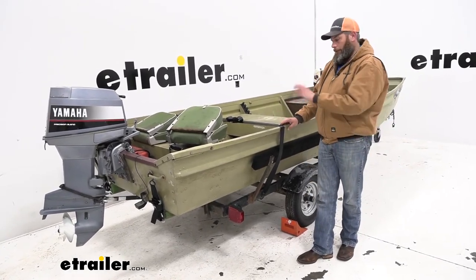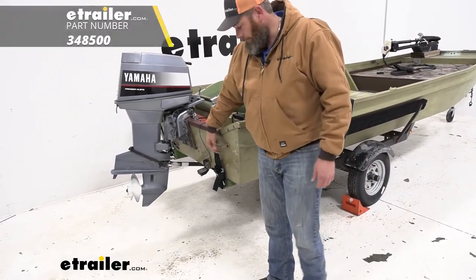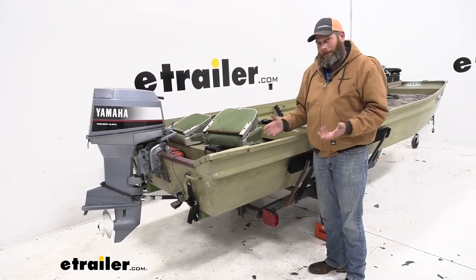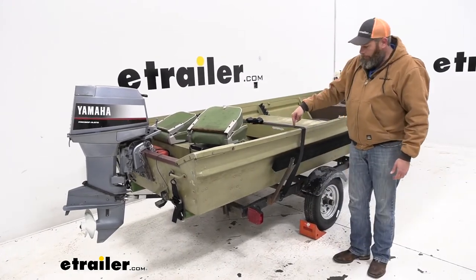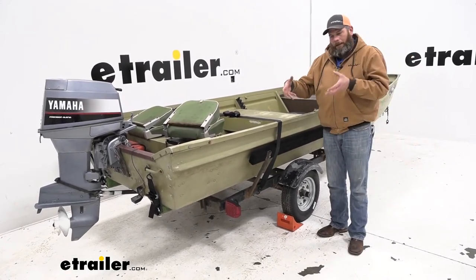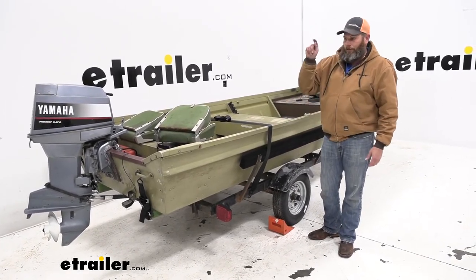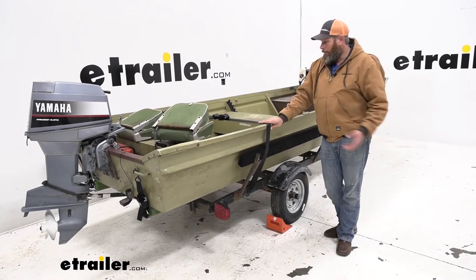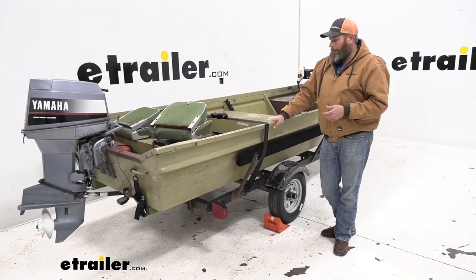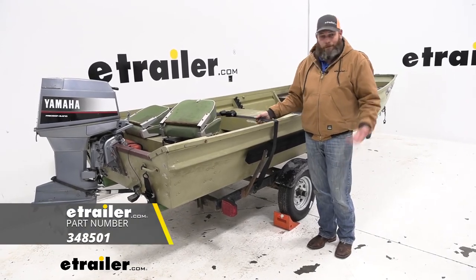As an alternative, if you didn't want to do gunwale straps, transom straps are made to connect generally to the handles on the back of the boat and then go down to the runner on the trailer — they're essentially doing the same thing. The gunwale strap is especially important if you don't have bunks on the side, as it helps keep everything more centered. If you don't have bunks, I would do both transom straps and a gunwale strap. Overall, there are fancier ones out there and some more basic ones, but this is a good solid gunwale strap. It's easy to use and it's certainly something I would own if I needed it.